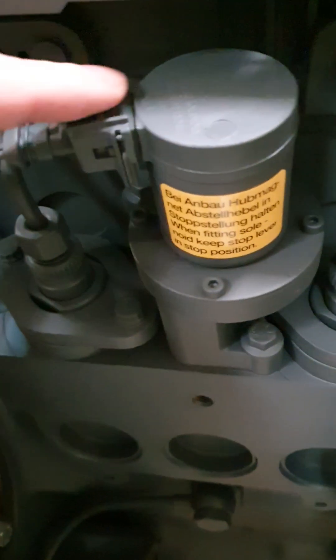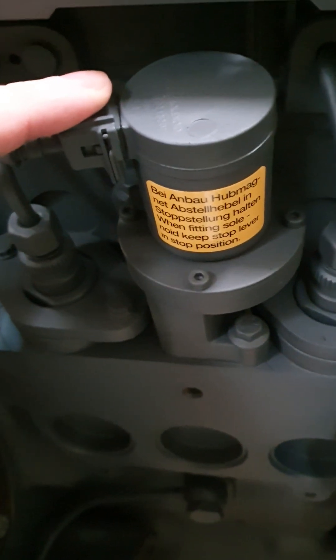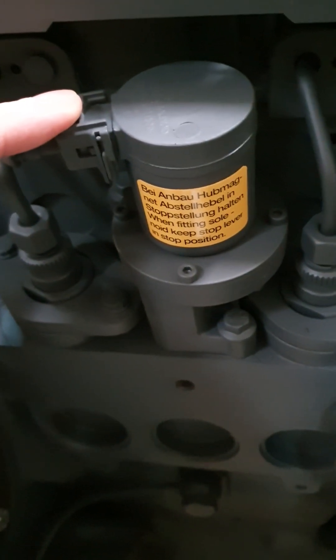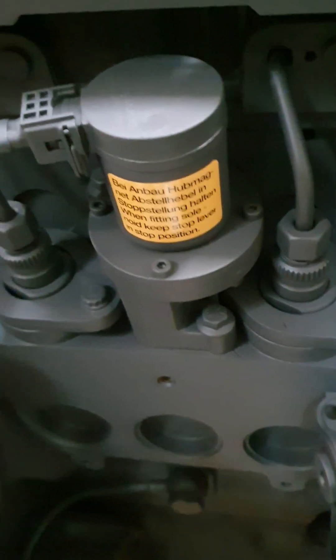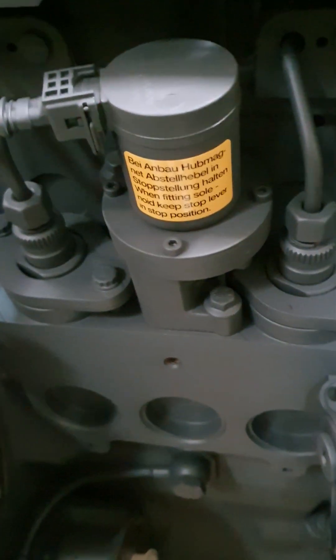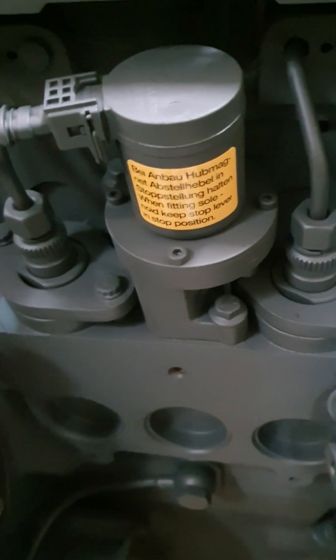Your stop solenoid is here. Probably the first thing you should check when you turn the key to actually start the engine — just make sure that's clicking, which if someone holds it you'll actually feel it click. That would normally indicate that it's operating.